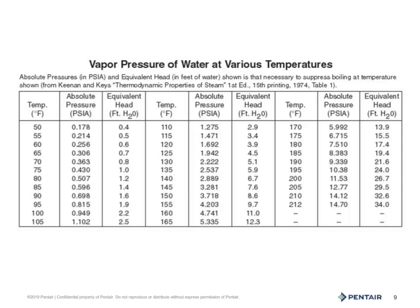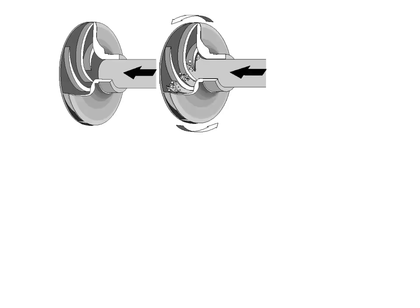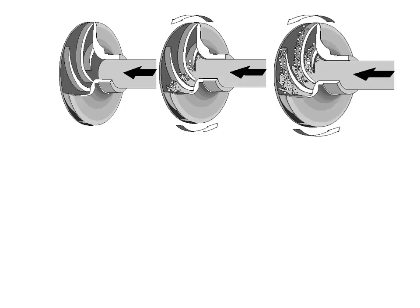That is what's moving the water to create a low pressure point for the water to be pulled into the system. And to do so faster than the design of the system will create this dangerous low pressure zone that will cause so much damage. Water is moving into the impeller, and the pressure and the velocity is at such a rate that the water cannot stay in its liquid form. It then flashes to vapor.